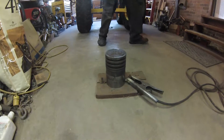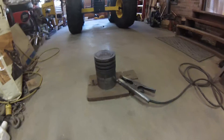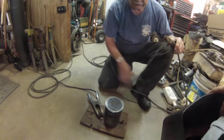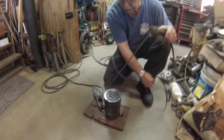Warm, warm — alright, so now we have our freshly heated-up piston and it's time to start welding. We'll flip the welder on. I'm going to tack it in four places, then go back and weld it, and then try to flip it and get some weld underneath as well. Alright, here we go.